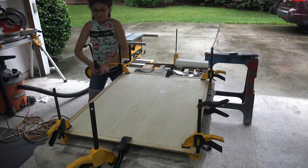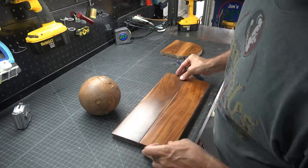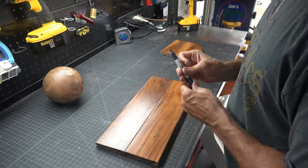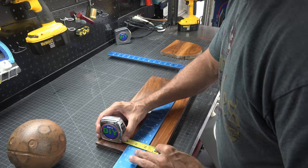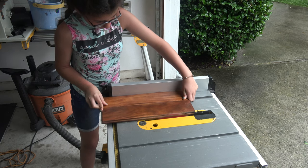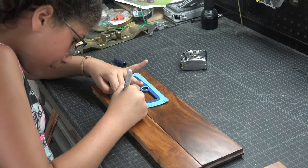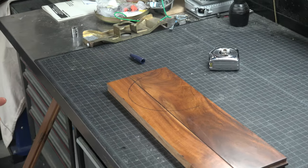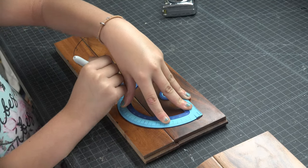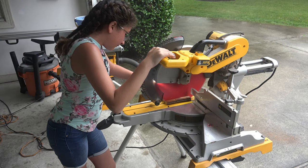For the lower two shelves, they don't need to be as big as the top one because these balls are a bit smaller. I take one and place it on my glued pieces of flooring — make sure no part of the ball extends past the back of the wood, because this is where the back plate will be. Trim off as much as needed to reduce the size. Remember, if you're using leftover flooring, trim off the lip on the backside before your final cut. Using a protractor, make an arch that will allow at least an inch-thick lip, then trace it out with a Sharpie — do this twice, one for each side. Go back to the miter saw and cut each piece separately so you have two.